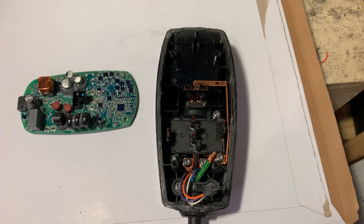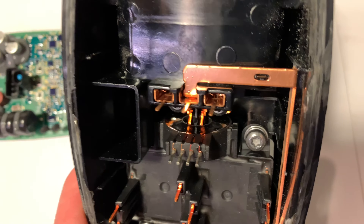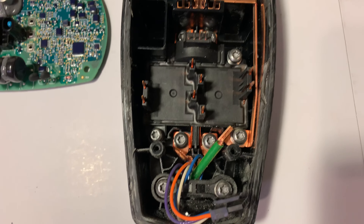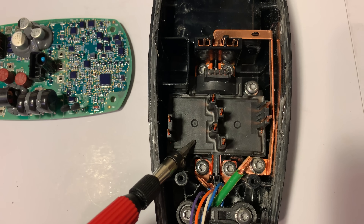Now the bottom has a relay, and what looks like a current sensor on top. But both lines go through it, so it's actually a ground fault sensor. After the sensor is the main relay, and I think there's voltage and current sensors for each line inside the relay.